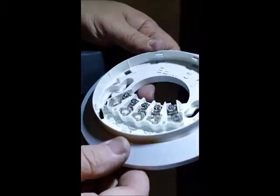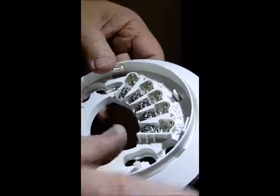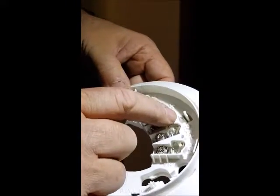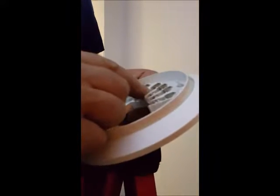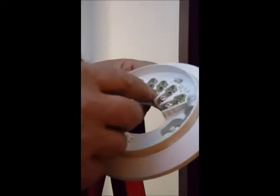The new smoke detector has three spots: two spots for positive and one spot for negative. One positive, which we found from the fire panel — this black goes here, and then another black goes here, and the two reds go to the negative.